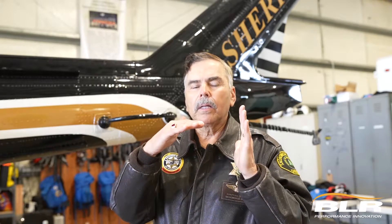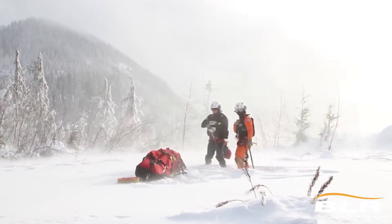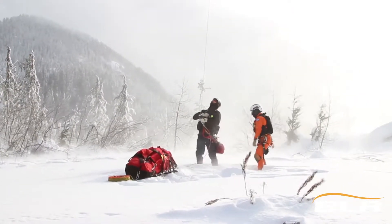I'll land down in the valley, offload some gear, burn a couple hundred pounds of fuel off, come back up to altitude again, and check that again. I need to have that safe pedal margin in order to safely come over the terrain and conduct rescue operations using a rescue hoist in an OGE hover. Having the strakes and the fast fin installed just increases that safety margin — that's the biggest contribution that this modification can make.